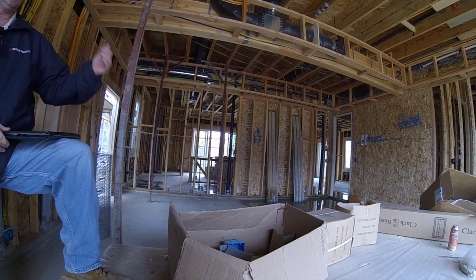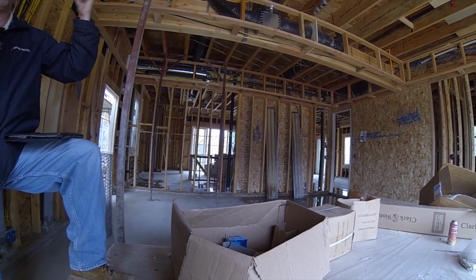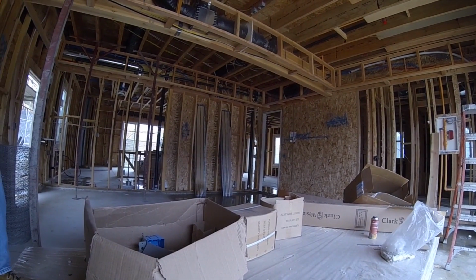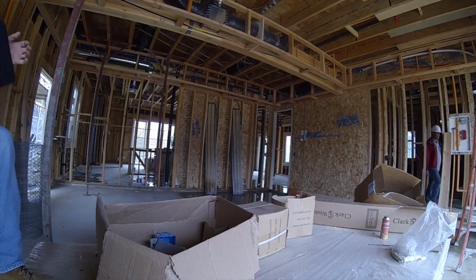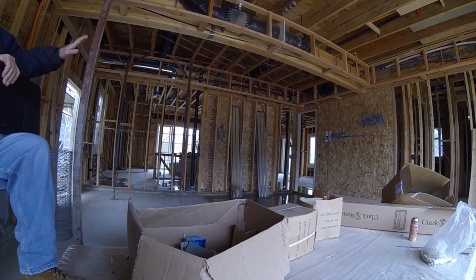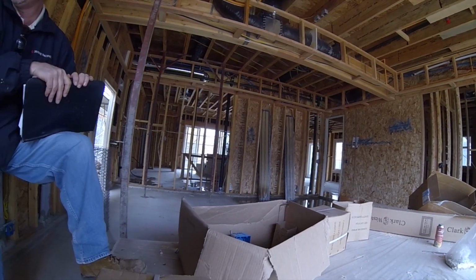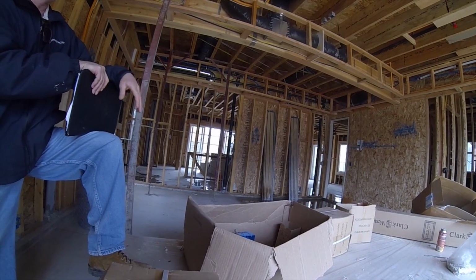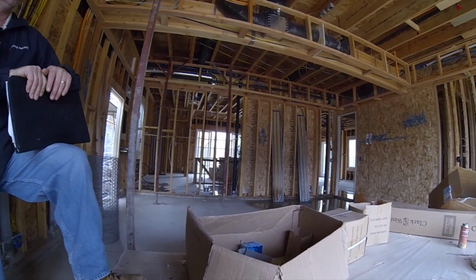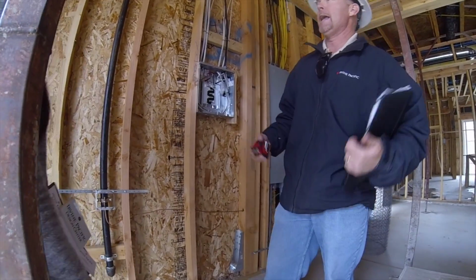At this point, I still have a whole other house that I have to do a MEPS on, which is your final walk of the house before I even do any insulation. So the water will be dried out before I put insulation in this house. If this was drywalled and insulated, then yeah, we'd be ripping everything apart. Because wood is milled in water, there's not even a problem with it. With molding, it wouldn't have... Nah, and again, lumber has mold in it naturally.